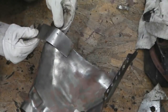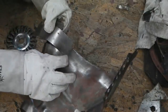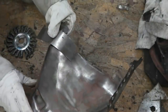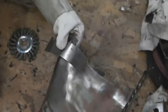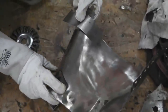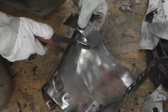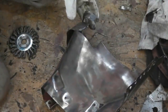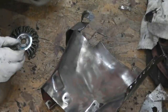We're going to get a tack in the corner and then start to let it follow the shape itself, and we'll bash and hammer as we go. I'm just hitting the tripod there. The tripod's magnetically mounted to the car, so I would have hit the car there. In comes a tack. Have we got an earth strap onto the piece of metal? No, we haven't. Schoolboy error. Connect the earth strap up and then we can get a tack on.